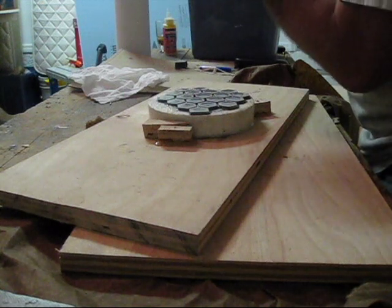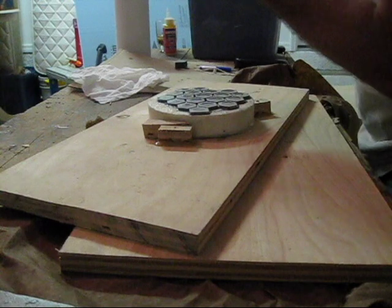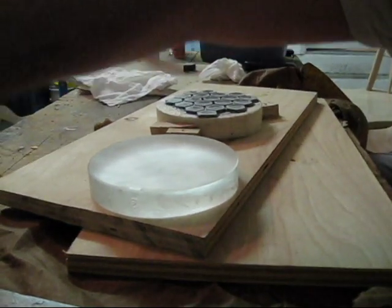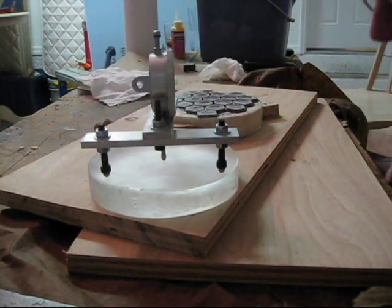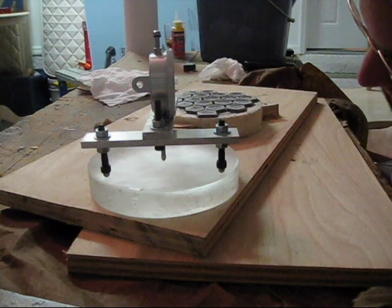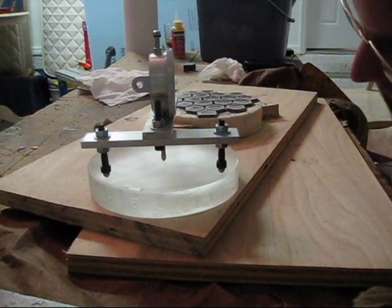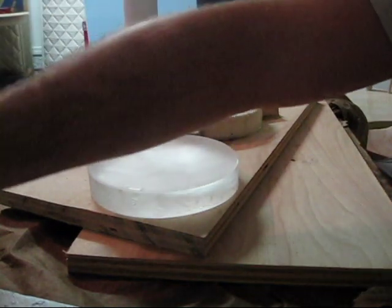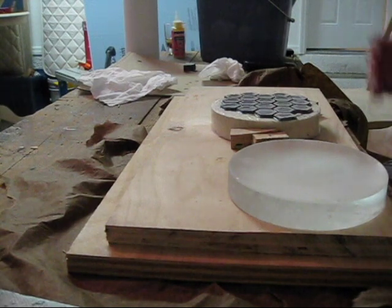I can tell the pits are a bit smaller than with the 80 grit. I wasn't expecting that to happen so quickly — I've only been grinding with the 120 for about 20 minutes. I was at 0.032 before, and now I'm reading 0.033. I probably need maybe 10 more minutes to reach my required depth, so I'm going to go ahead for 10 more minutes. I just took off about a thousandth of an inch in 20 minutes — that was pretty quick.